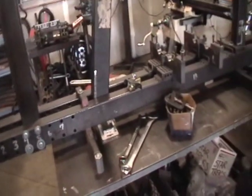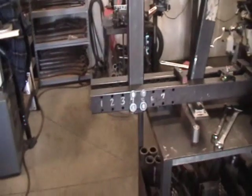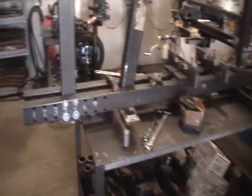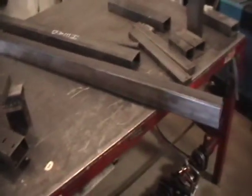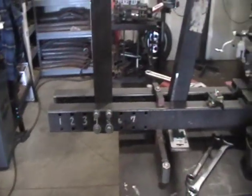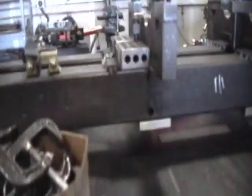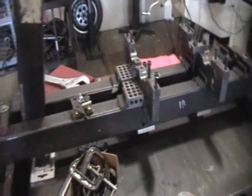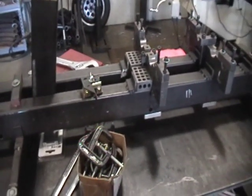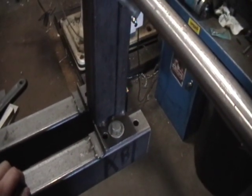What we did to make this piece — it's pretty simple, but it is a precision piece. There are a few different procedures you want to go through just as a quality check. First off, we started with a piece of 3x2 steel square tubing, cut it to length, and we're going to put it into the mill and drill these holes here. A little bit later on, we'll drill the holes in the center which would hold the king post if you were doing a big twin build. Then later on, we'll drill the holes in the top that will hold the rear stanchion that locates your axle.